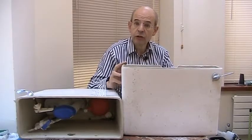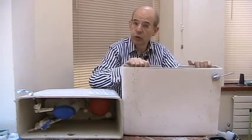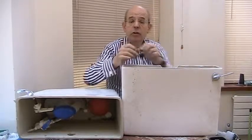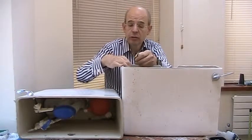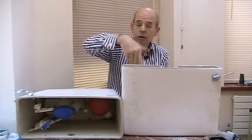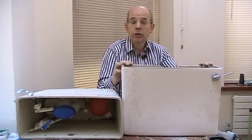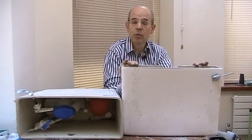You need to check the cistern fixing screws. Some modern close coupled toilets don't fix the cistern to the wall but most do and they have two holes — if you take the lid off and look inside you'll see the two holes. The screws used are traditionally brass because they don't rust, but sometimes you'll see screws which are just ordinary steel screws that have rusted, the head just goes, and you may need a hacksaw to cut through the bolts in the back. If you really want to put new screws in the same position don't worry, because you'll be able to silicone the cistern to the wall and fix it that way.